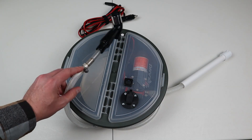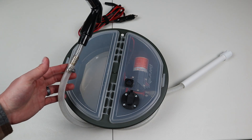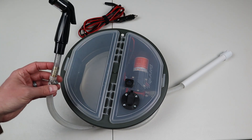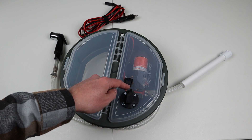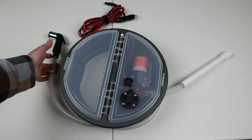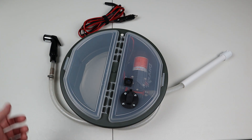One little tip right before ending the video: I did put an additional hose clamp here, just like the ones inside. I added it because when I started using hot water, this actually started popping off and leaking — so I'd suggest securing this down. There's no way it would cut or hurt anybody as it's far enough from the handle. The last thing I'd recommend is do not store this in freezing temperatures — the pump could have frozen water and it could cause damage to the sprayer. Make sure if you're storing this in a winter environment, completely take all the water out, and then you won't have any damage to your sprayer or pump when you come back next spring. Thanks for watching the channel guys — really appreciate all my supporters. Hope you guys build it and let me know in the comments. Have a great day!